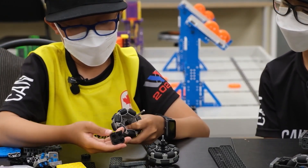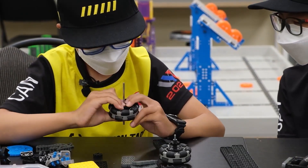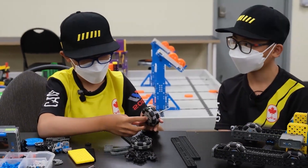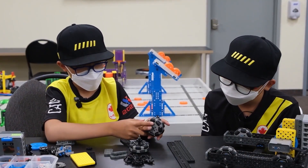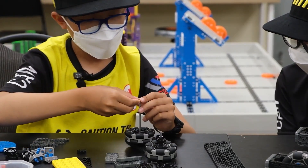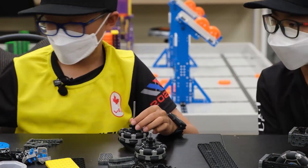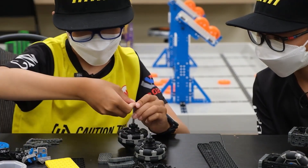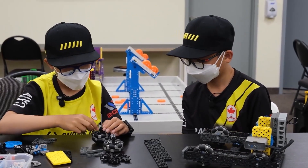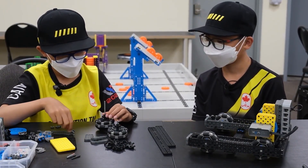Now I have to put a two-by-two with a square in the center with some two standoffs. Now you need to use the spacer and put it in here - this is because the Omni wheel sticks out a bit, but this is the right spacing. Next I'm gonna get two spacers and put a hollow sprocket, one lower spacer, and two washers. How come you need all that space in front of the sprocket? Because the chain when it's on the sprocket has a bit of thickness, so this is the exact spacing you need for the chain.